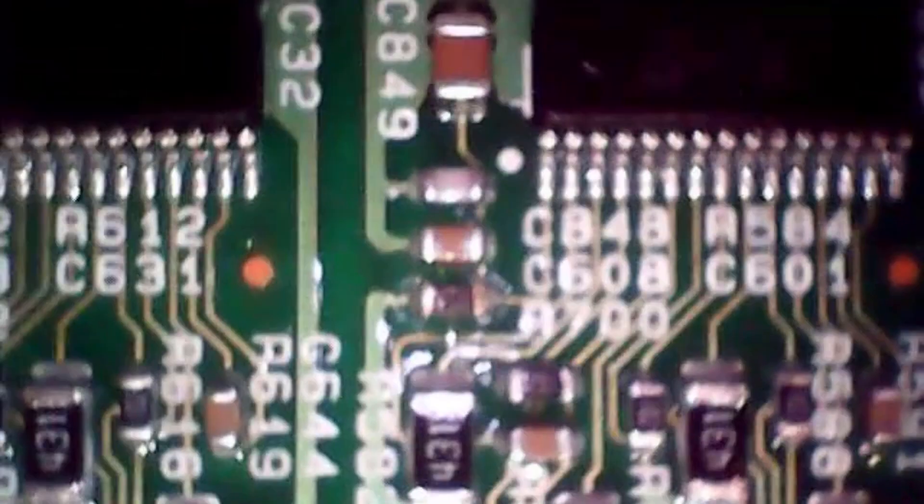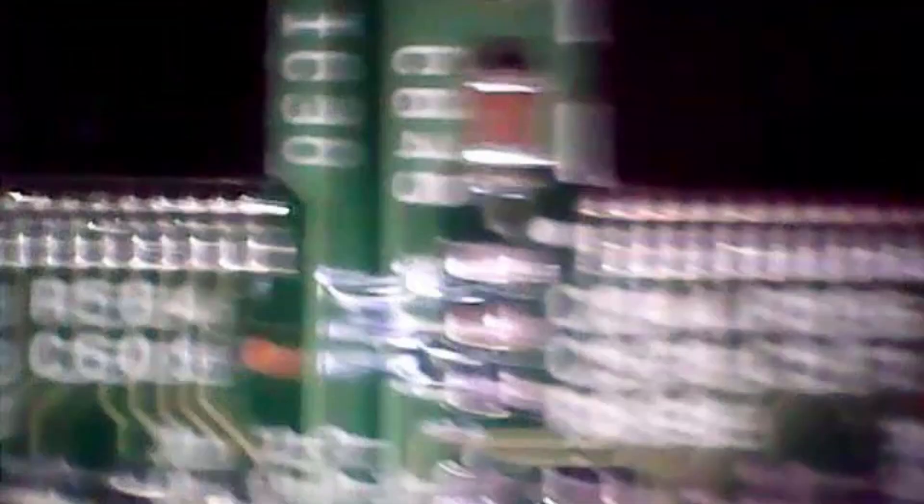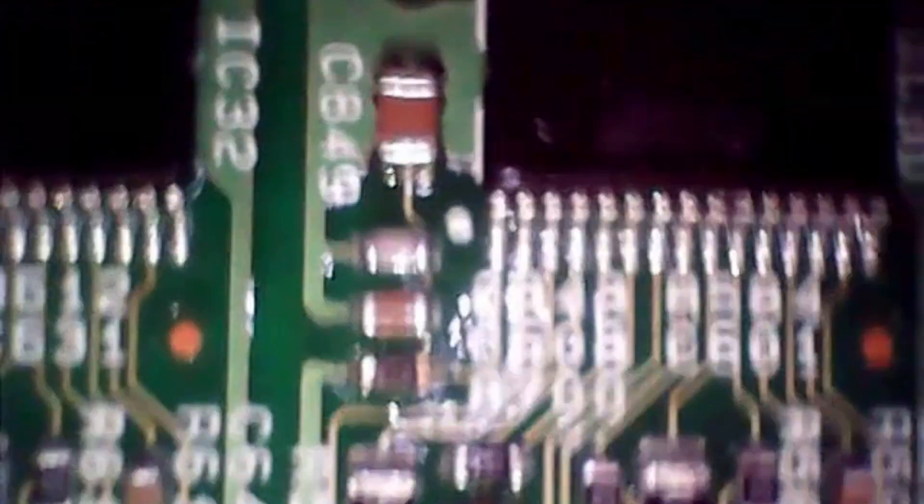If I come up here there's a resistor right in the middle - just a 10 ohm resistor, and there's one on each group. The one over here you can see is fine. This one has the casing burnt off completely, and over here you can see again this one's got some writing on it, but back here it's got nothing at all. So clearly that resistor's gone. I've tested it with my multimeter and that little 10 ohm resistor is dead, and so is this Zener diode. All the other resistors and capacitors all look fine and seem to test okay. It is very difficult to test things in-circuit, but you can get a rough idea, especially in a mirrored layout like this where you've got lots of the same circuit - you can check one against another, and as long as they behave the same it's all good. It's just these two components that look like they've died.